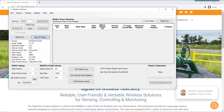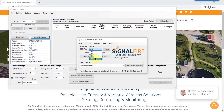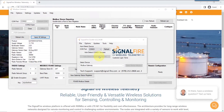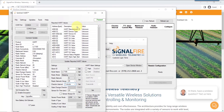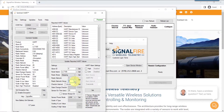Part two is to now set up the sentinel. Select the proper COM port of the USB 4-pin cable and click on auto-detect. The software will automatically detect that there's a sentinel attached to it, and you'll see the specifics on the left-hand side as well. We'll match the radio network group, network, and encryption key — so pick zero and one, which is what we had set previously, and hit the set button.